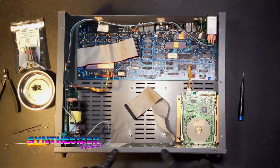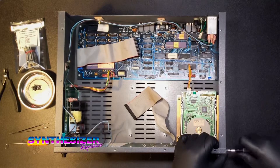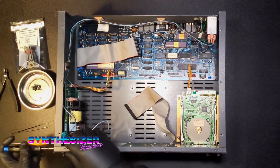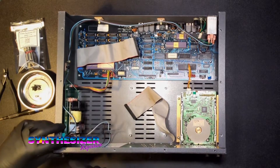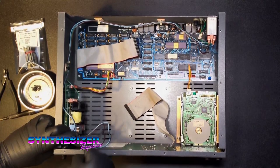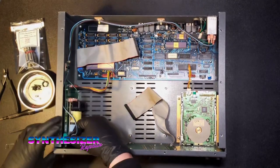On the bottom side when we take the bottom off, we remove some of these Phillips screws. On the top side there are four screws - I've already removed those previously. The only thing holding this display in place now are two remaining Phillips screws on the side. I'm going to remove those now. We also need to remove the power switch which is mounted to the front display - just a couple of plastic nuts hold it in place. There's a nut on the rear that sets the depth and then a plastic nut on the front that screws right off, and then the switch will pull right out.